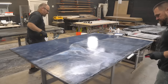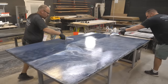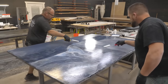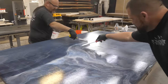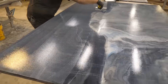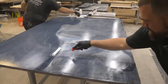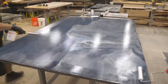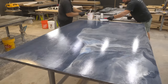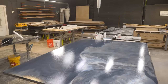Now I'm gonna start to dry roll with the wet roller. What's nice about shower panels is they're vertical. And on vertical, you actually hide even more imperfections. The light's not hitting the entire piece at the same time like a ceiling or a countertop. Whenever you're doing drywall, the walls are much easier than the ceilings because the ceilings show everything. Okay, I'm gonna grab my dry roller and then I'm gonna go with the grain here.